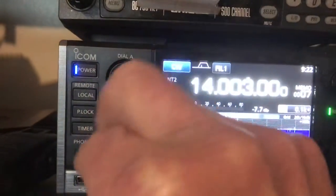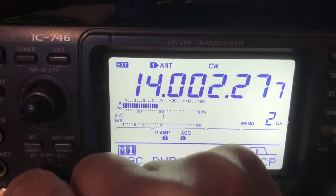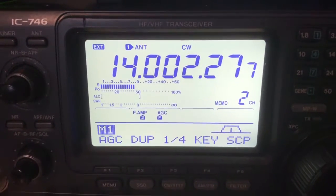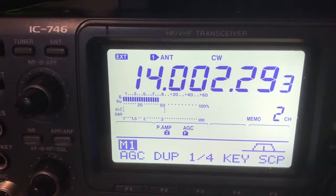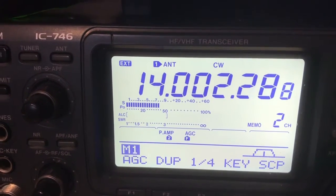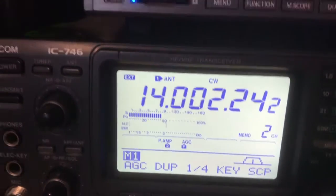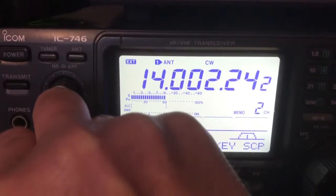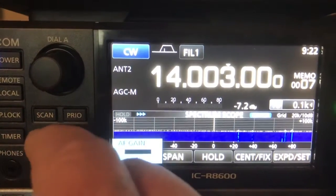Let's go back over 20 years in the Wayback Machine. This radio is an ICOM 746, and it specifies 1 hertz as well, and it does the 1 hertz tuning, as you can see here. So when you're trying to tune in a CW signal or RTTY or whatever, it performs just fine. They specified it and did it with this radio. They specified it and did it with the 7300, but they specified it and did not do it with the R8600.